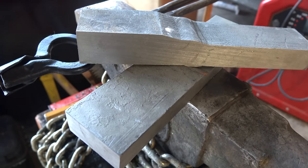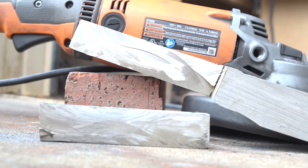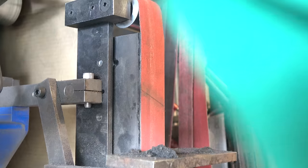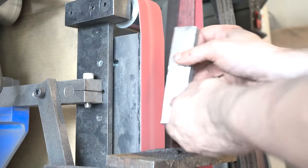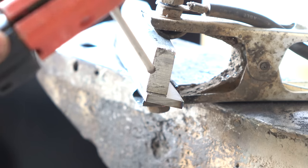Obviously we're going to want to cut this down unless we are planning on spending hours drawing it out by hand. Next we'll grind our piece flat and arc weld the 1084 high carbon steel to one side in preparation for forge welding. The 1084 will make an excellent knife edge. The A709 bridge steel will not.